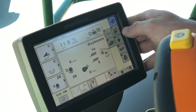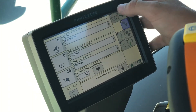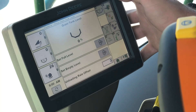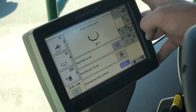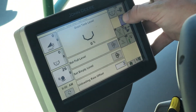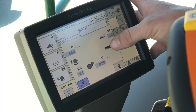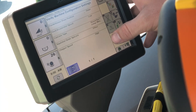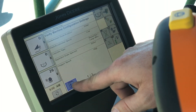If we go back to the combine page, we can go to the next button down — H — our setup. This is where we change our crop. We can see our grain tank level; we are empty, so I'll go ahead and set the empty level. I would recommend setting the full level too as you get to that full point on the grain tank. These are going to be our default soybean harvest settings. You can come in here and change these — hit the setup arrow and it's going to take you to that page and show your machine settings outside of the cab.